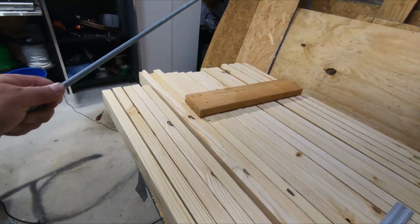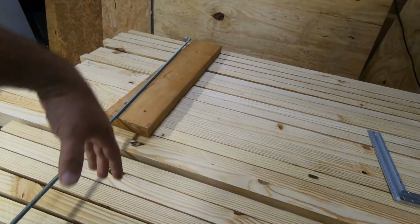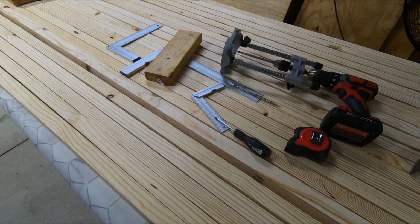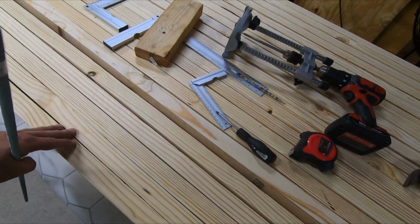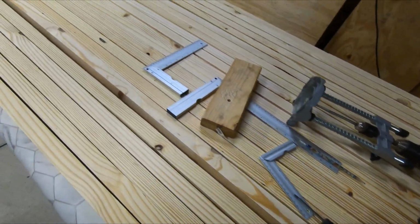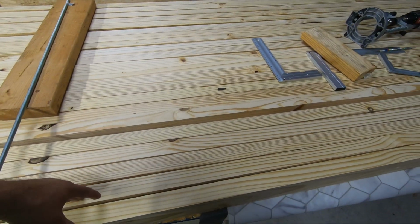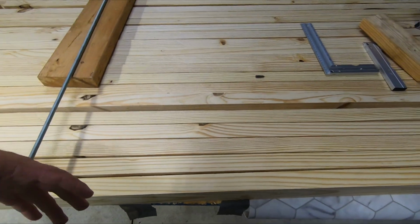and then I will start it with the first one kind of like this, and put a bolt in it, and then I will slide on each piece. And I'll have to set a timer for like 20 minutes or so. The clamp time on the glue, the time before you have to clamp it, is 25 minutes. I think I'll set it for like 15-20 minutes, and I'll just slather the glue on, put it on, and if I'm bringing the new board on from all the way to the other end, so say I have two boards, and I'm sliding a board down, I should be able to slide it on pretty easily. And then if I have any trouble due to undulations, I can draw it in with the clamp.